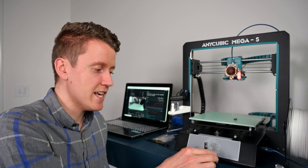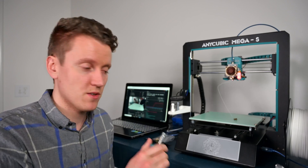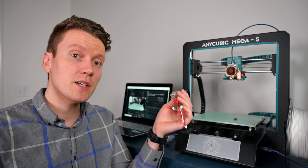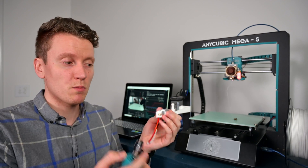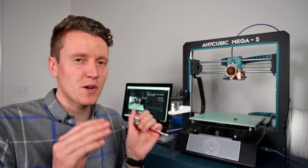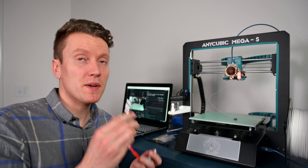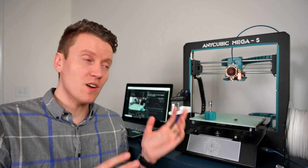Make sure there's no extra filament oozing around between that joint. If there is some oozing coming between the nozzle and the heat break, you probably should print the larger size of the blades that fit inside here — that will give you more torque on the torque wrench. It's also important not to over-torque this; if you feel like you're putting too much torque on there, you can strip out those threads. Luckily this printer did come with a whole extra hot-end assembly so I could test it out here. But for most people, I would recommend just being careful — don't over tighten it. If it feels like you're going way too hard and you're about to strip things, back off a little bit. You could try printing the smaller version of the blade; that will decrease the torque limit of your torque wrench. But this one's working really well for me — the filament is coming out correctly with no oozing around the top. And that's all it takes to change a nozzle.